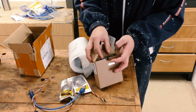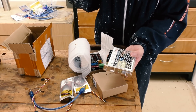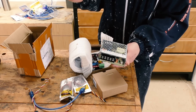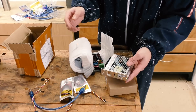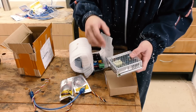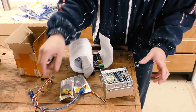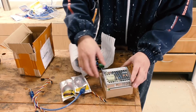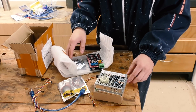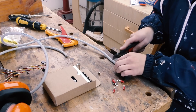This is our power supply. The separate motors I'm using are 12 volts and 7.4 volts but the power supply is 24 volts - that actually doesn't matter, the voltage just needs to be equal or higher, and if it's higher it's better because you get more torque out of it. The amps should be enough - it's about 3 amps from the power supply whereas the motors in total probably only require like 1.5 amps, so that should be all good. I guess the rest is just wiring all the cables together and hopefully nothing goes wrong. I am no electrician so don't take any of this as true.